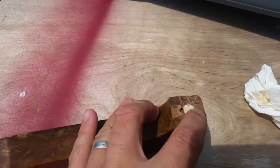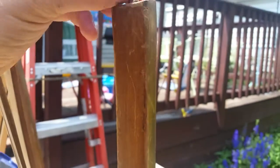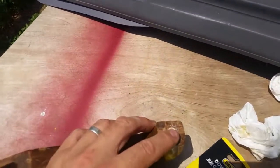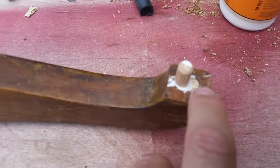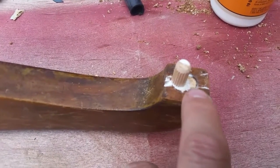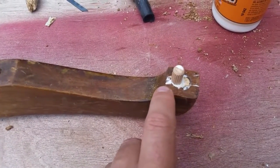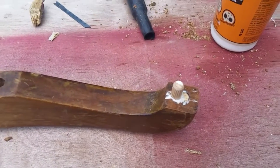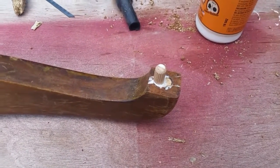Now I cut it and I have a nice flat surface to work with. I'll take this little tool set and do it again carefully — pop that in here. Now when I line it up, it will push right where it needs to be on this flat surface and I should be able to get a correct-size dowel to throw in there. But this is not where I was pointing — because of that small divot right next to the dowel, it slipped. So I'm actually filling it with yet another dowel. That's just what you have to do to make it flat, so you've got a nice even flat working space. Then once I've got it again I will try — hopefully third time's the charm and I won't have any slippage.